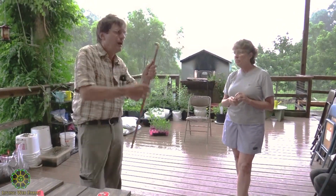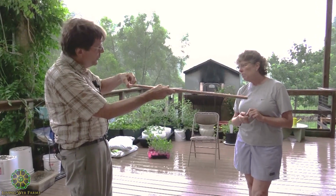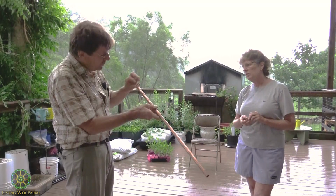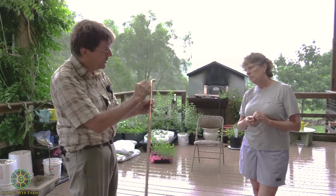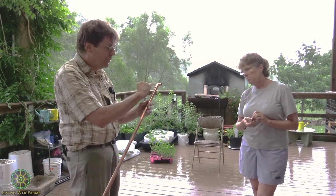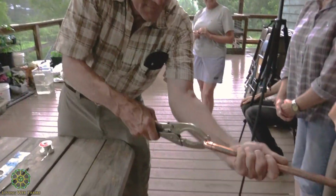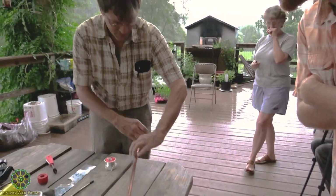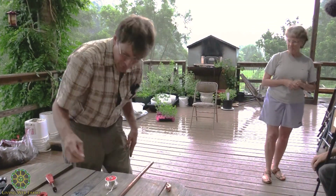But what I was getting at was that that shoulder has to communicate cleanly with that pipe. So if that little teeny shoulder was dirty, it's not going to seal, because that's really where the seal happens. It happens inside too, but it really happens on the outside. So now we're going to, okay, here we go. Thank you. Okay. So now I'm going to take the flux.